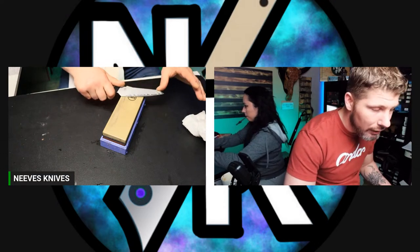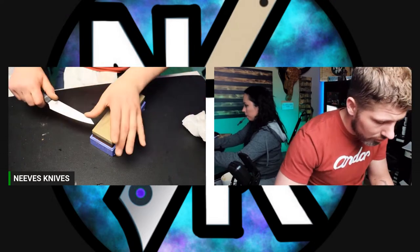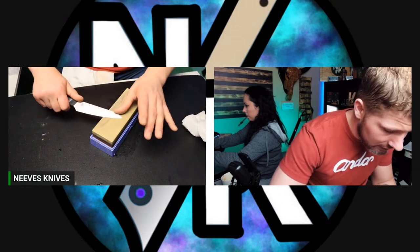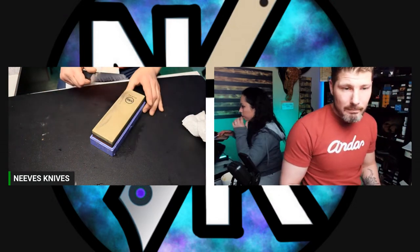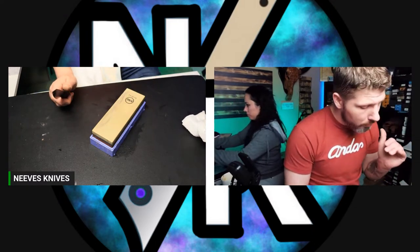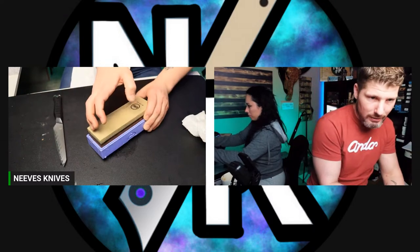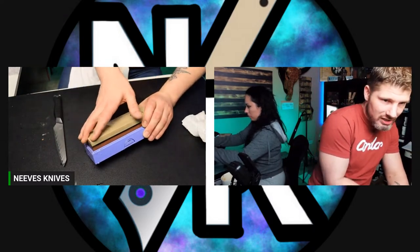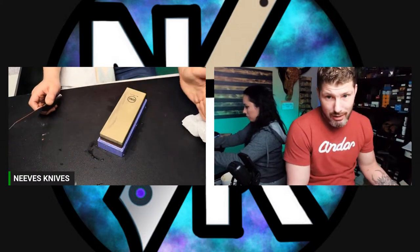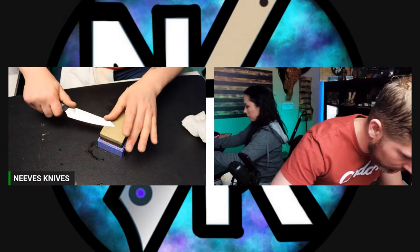So very, very lightly. This is one of the biggest mistakes people make: they'll do the edge trailing pass, or they'll even do just a regular forward pass like this, and they'll put pressure. The pressure you were just using to sharpen, throw that out. No pressure, because the burr is just going to snag. Say if this was the burr, you just want to catch the stone and snag it off. That's it. It doesn't take any pressure to do that. So it's very easy to knock the burr off. It's fragile.